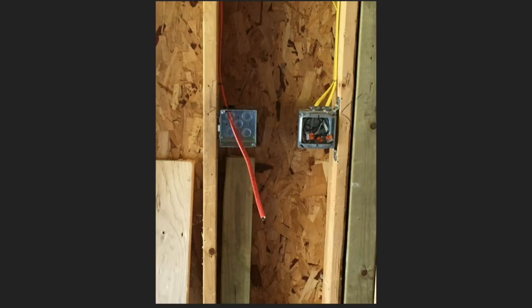Made some friends — some frog friends. In the garage side of the building I put in a few 30-amp 240-volt circuits for machine tools hopefully in the future. Those should be able to handle about a three horsepower motor. I did one circuit for a five horsepower motor in the corner thinking I might put an air compressor there. Still may, but really the electric tools are getting so much better these days it's hard to know if it makes sense. If you're going to spray or do certain things you just can't do without air you need it, but for an impact wrench or air ratchet, some of the new cordless electric stuff is just as good maybe.